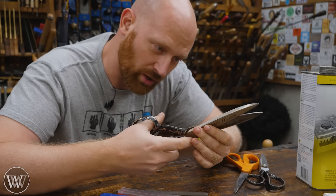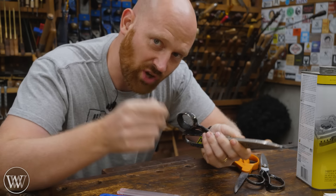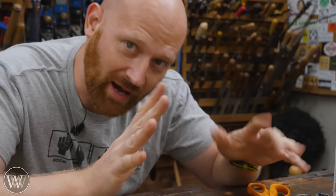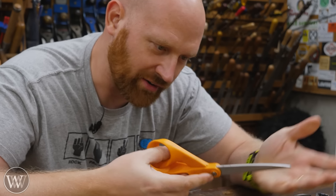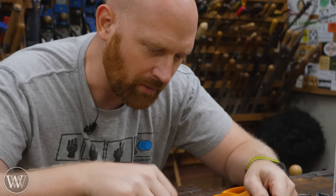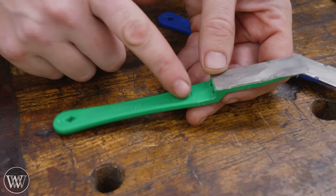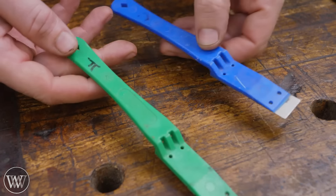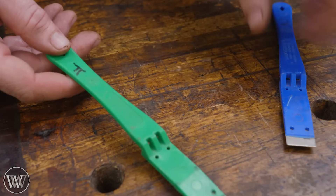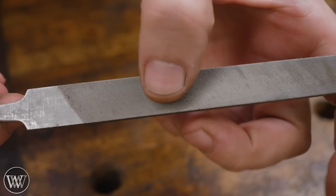Most scissors are designed to be sharpened. They are a relatively hard steel, but still a little softer than a file so you can easily clean them up. There are some modern scissors that are very, very hard — those actually need diamonds — but for most you can do it with a file. I use these diamond paddles from DMT Diamond Sharp, and I'll leave a link below. They come in coarse, medium, and fine, and I generally just use the fine unless I need to do a lot of work. You can also do it with just a regular file, something really, really fine.